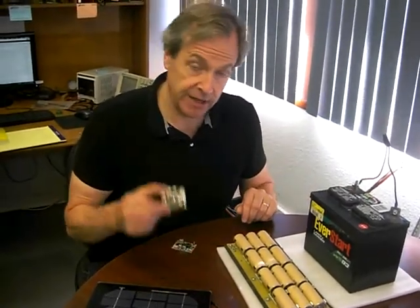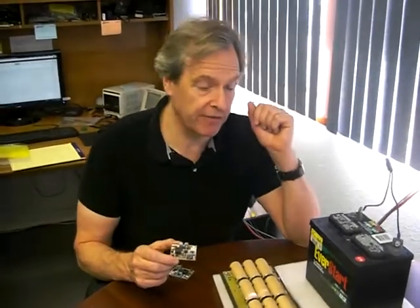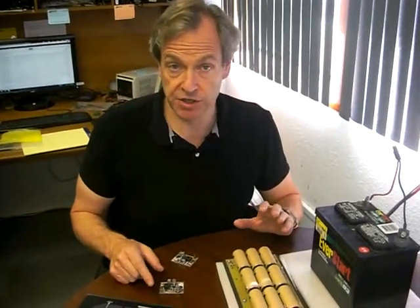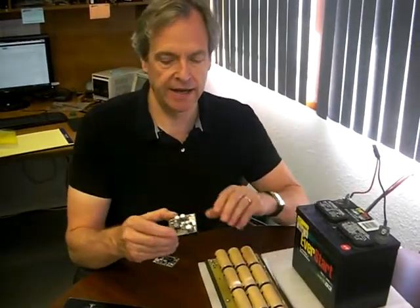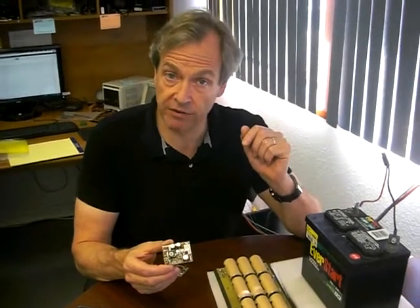With the selectable battery chemistry, you can charge either the lithium type or a 12-volt lead acid. A really neat feature is that we've added the capability to recover a completely discharged battery in bad weather. So for northern climates, marginal conditions, or if you just want to save money on the solar panel, this is really the way to go. The SP1008 is available for shipping now.